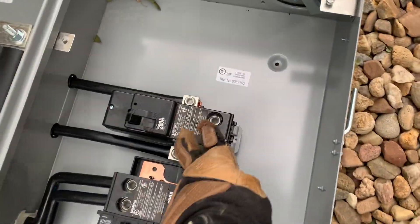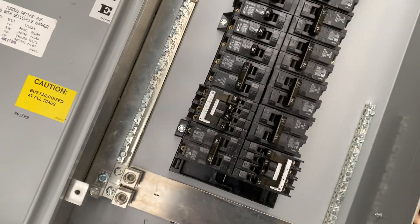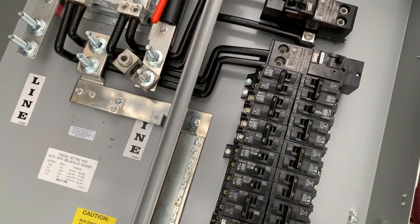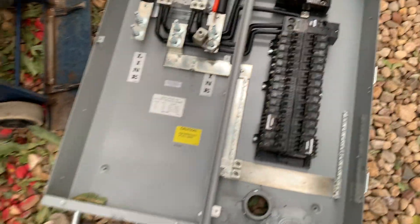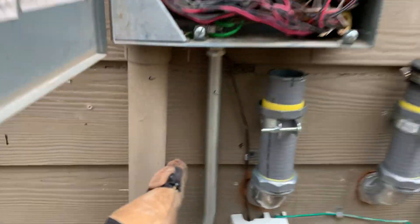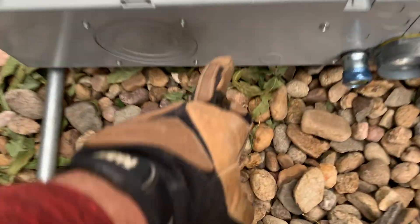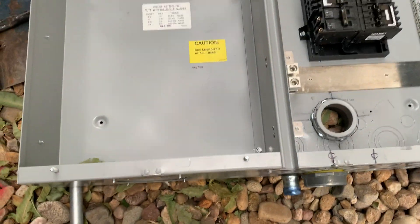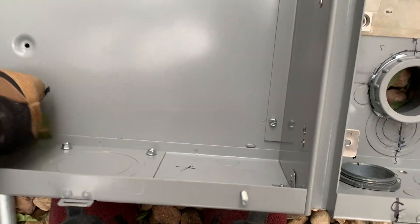So one of the 200 amp you saw downstairs on the left will feed going here. The other 100 amp will feed going up. I hope that lines up. It looks like that conduit will fit because my cutoff is right here for 3 inches, so this will fit right in that bay. I think it will be knocking out a 3 inch right here, so that should fit perfect.